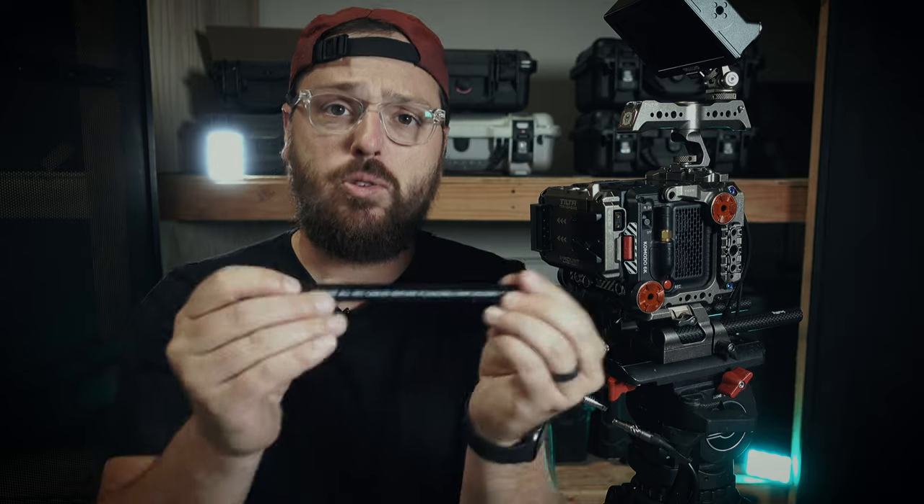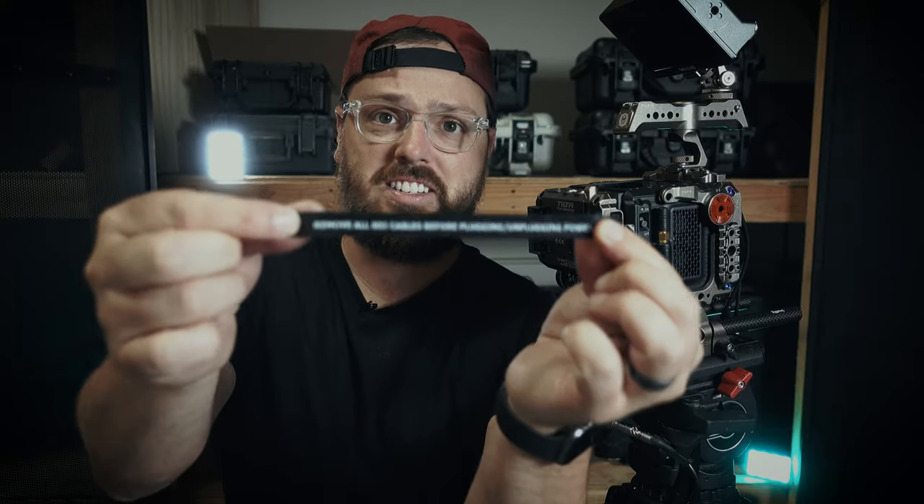As I've been looking at forums and Facebook groups, I've seen a lot of people approach this issue with a sequence of steps when you get to set and power this on, and another sequence when you power this off. I see it way simpler than that. It's just this: do not have any SDI cables plugged in when you are plugging in power.